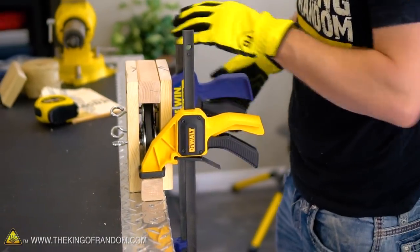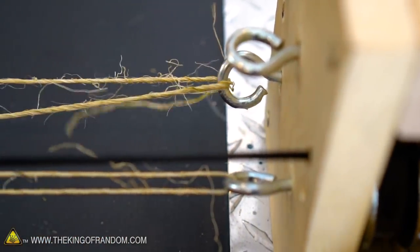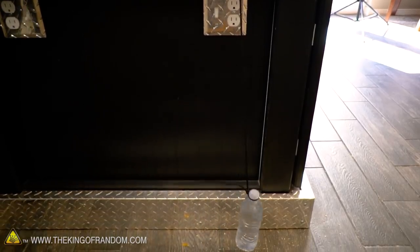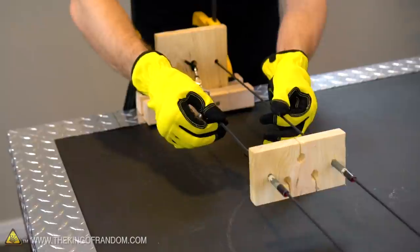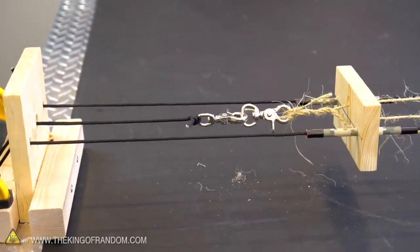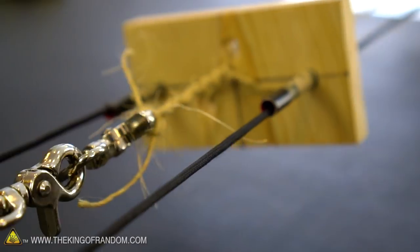Update: we've done a lot of work today — we've rigged up the system and it's all clamped to the bench. We have a hook spinning system powered by a cordless drill. On the back end we have a support board that accommodates a counterweight system that hooks up to a set of double swivel hooks. We've added two ropes between the spinner mechanism and the backboard to accommodate this automated rope making top. As tension builds, it will glide forward and guide the individual strands into place to form a three-stranded rope.